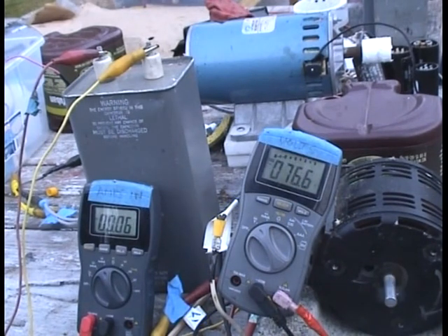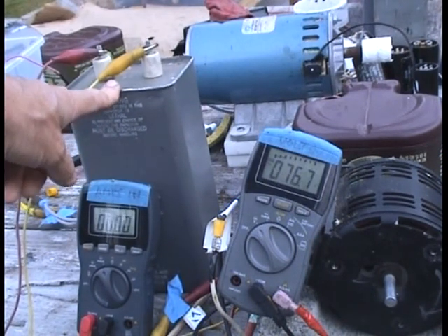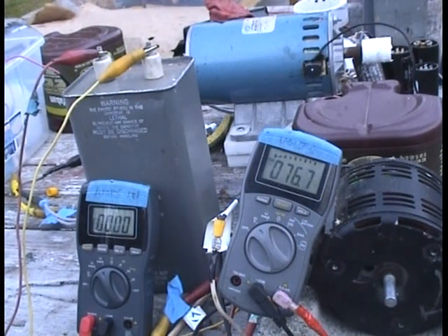77 volts, down a little bit — 0.06 amps. Now I'll unplug the roto-verter, and it's running. So there's an AC motor design that works. It's drawing a lot of amps right now — about two and a half amps or so — but it also has a lot of torque on that shaft. I just got it going, haven't really tuned it, but I did get it going. If I don't have an 88UF cap it's not going to work, but I'm sure there's a perfect size cap — that's just what I got it to work with right now.